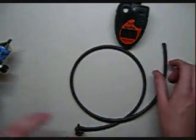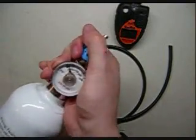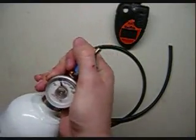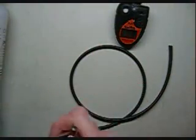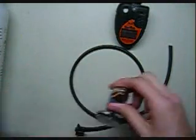Remove your tubing from your calibration gas cylinder and unscrew the regulator from the cal gas. Never want to leave a regulator on the cylinder — it always has the potential to fall over, and occasionally the gas in there will react with the inside of the regulator. It doesn't happen often, but occasionally it does, so better safe than sorry.